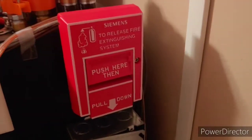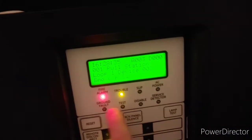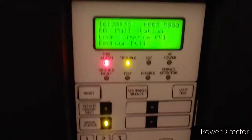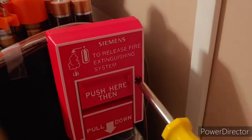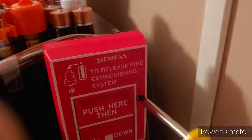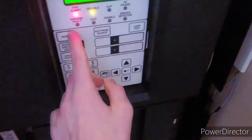Let's go ahead and pull our second pull station — that is the MH-501. Here we go in three, two, one. Okay, so let's go ahead and reset the panel. I forgot to reset the pull station, so I already reset the other one — I'm just going to reset this one. We just unscrew, then put it back, and start to screw it back in. You don't want to make them too tight or you'll break the pull station. Then we go back down and actually reset our panel.